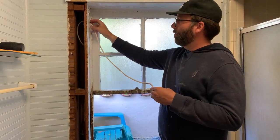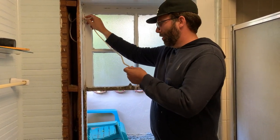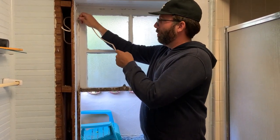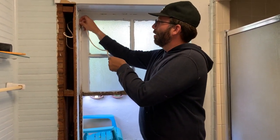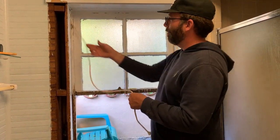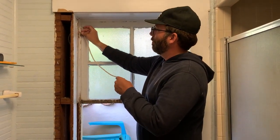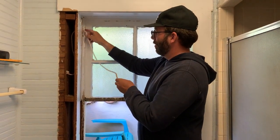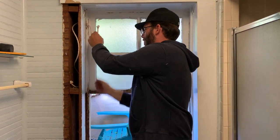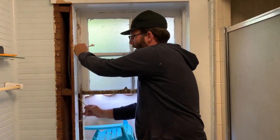Now if you're having trouble finding the rope, what you can do is just use a bunch more rope — keep feeding it in there until you eventually find it. I'm cheating a little bit because I can see that it's getting stuck. So as an example, not every time is perfect. If you can't find it, just pull it back out and feed it through again. This time it seems to be going down a little bit better. Okay, reached up and grabbed it.